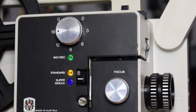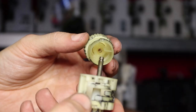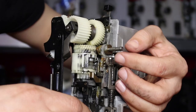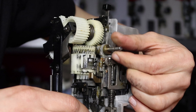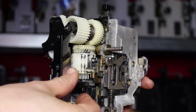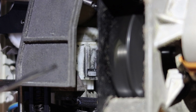So now back to the 610D with its 6 slow motion settings. Imagine that cam and its principle, then stack any cam you want on top of it and place it inside the drum. The cam always spins when the motor turns but it cannot engage the claw lifter because they can't reach it. The drum it spins inside of has the pressure pieces it needs to reach the claw lifter, and this drum can also rotate. At the various speed settings, the corresponding pressure piece is placed between the right cam lobe and the claw lifter. This way you can have different film speeds and never change the projector's running speed.